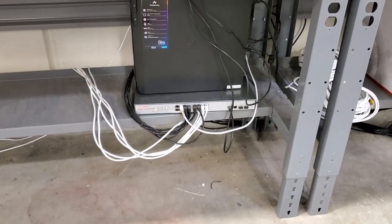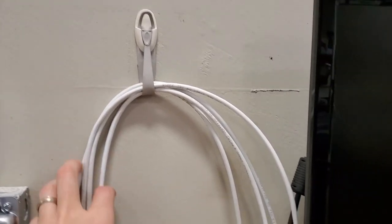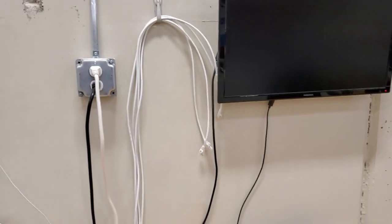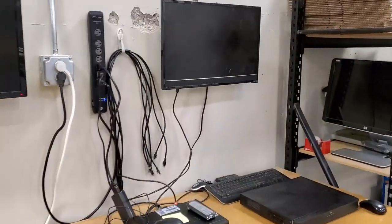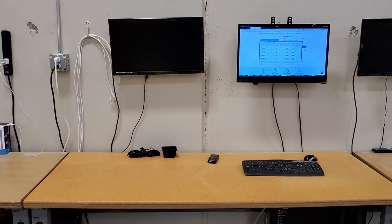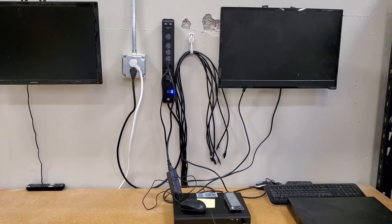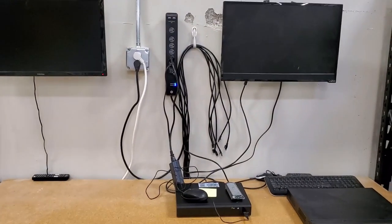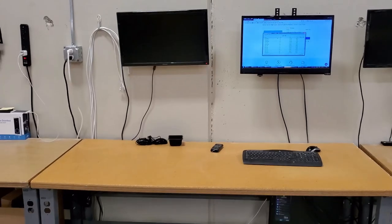You're going to need a PoE switch on your test bench if you're doing IP cameras. I have this cable going over here, looping up and kind of out of the way. I have a little double-sided tape thing that just holds the cable, and those are all PoE connections — right there, nice and handy. Normally what I would do on each station is put a power strip up on the wall, like that one over there, with PoE cables coming into it and a monitor for your computer and a monitor to hook up your DVR. It's literally just ready to go, super efficient.